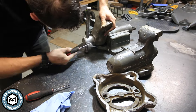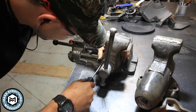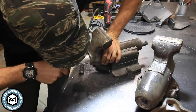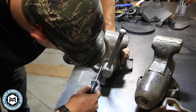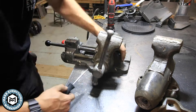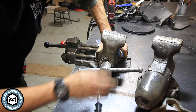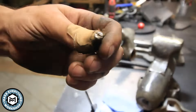There are three screws keeping this locking plate in and two of them were stripped. So I went in there with the Dremel and a little cutoff wheel. Here's a little trick: you can actually cut a slit in a stripped-out screw and make it into basically a flathead screw. This will generally work on any type of screw or bolt — as long as you can get a screwdriver on there, you can usually get it loose. This screw was pretty chewed up and I was still able to get it out.